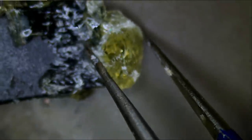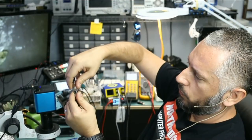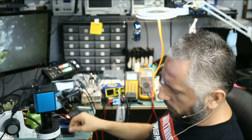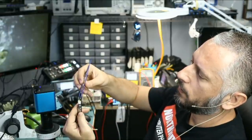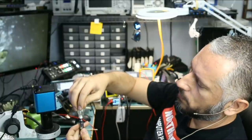When I applied hot air onto the flux, I took some with this plastic spudger, and now I can break a piece off like this. I take that piece of frozen flux and put it inside the core — we pop this open, place that piece inside, and close it.